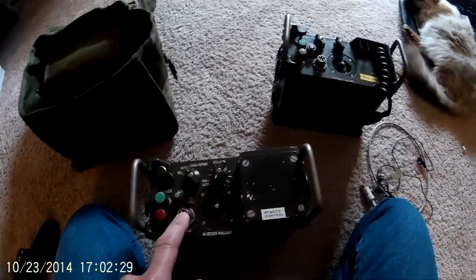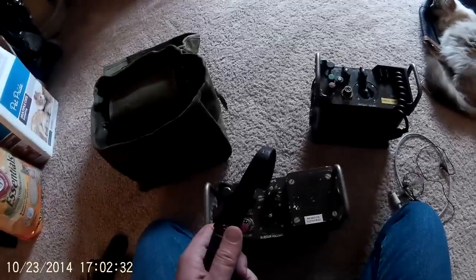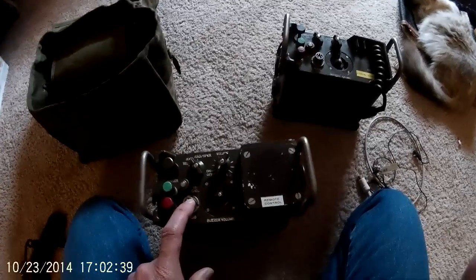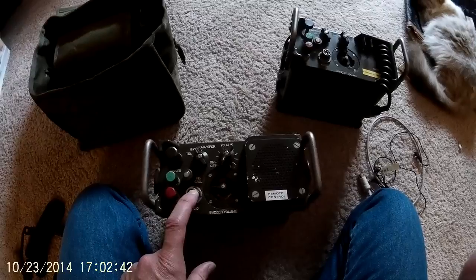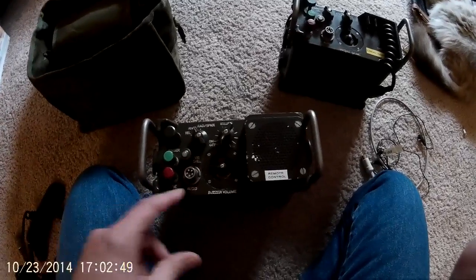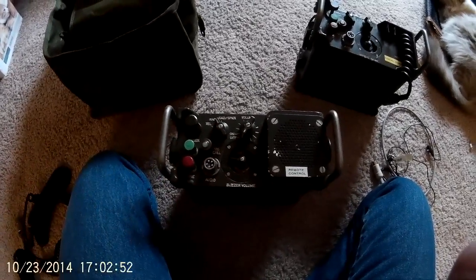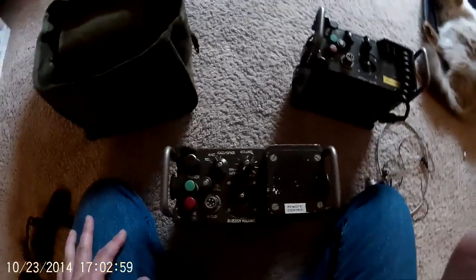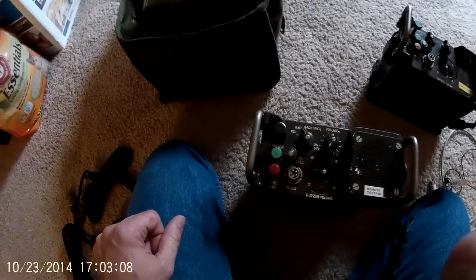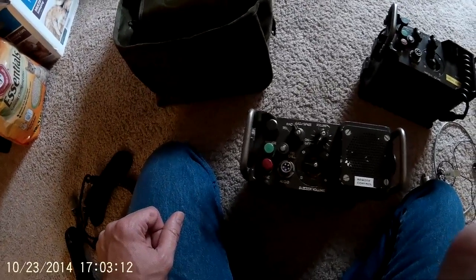When connected in, you can tie in here with this connection for the phone to regular connect in. I made up a box for this to speed things along because the wiring diagram is ridiculous looking, so I built a box with all labeled binding post connectors. Click into here and from there you run all your control wires — run this to the line pack, run this back to these terminals, and you're done. You can use one line pack on the SB22. If somebody rings here, it's going to trigger the doll's eye indicator on the line pack and the ringer on the SB22.